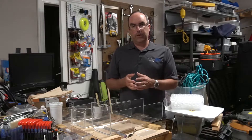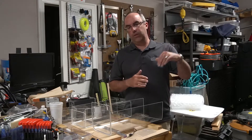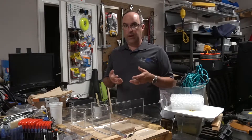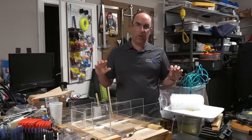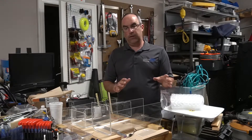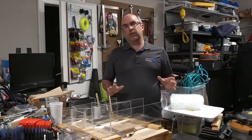The next step is to bend it into place, and this is where I've finally made some choices that have really helped me out. You can always bend acrylic with a heat gun — you go back and forth constantly over it — but you end up heating a much wider area. They sell really nice strip heaters at great expense, ranging from $200 to $500 on eBay or Amazon. I have a solution that's much less expensive — probably in the $80 range.